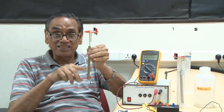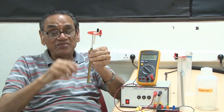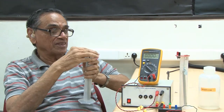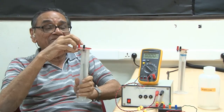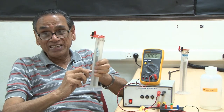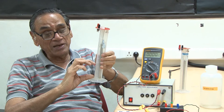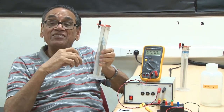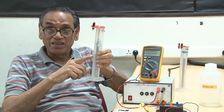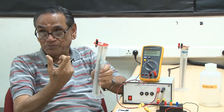This capacitance is now filled with air. When I put this capacitor in a jar and fill liquid through this nozzle, the liquid will fill the capacitor to different heights. The liquid has a dielectric constant different from one, so the part filled with liquid will have a larger capacitance value, and the remaining part will retain the air capacitance value. The total capacitance will be more and the output voltage will correspondingly increase.